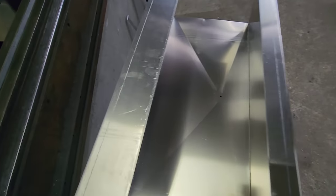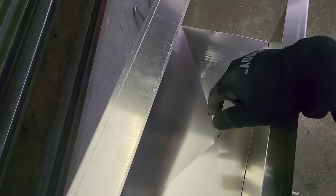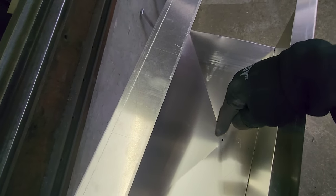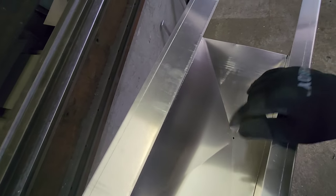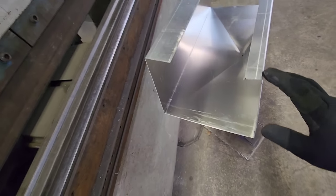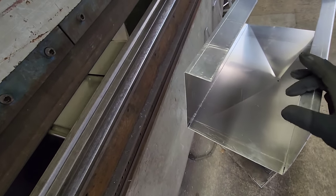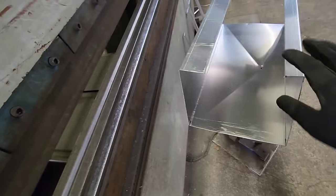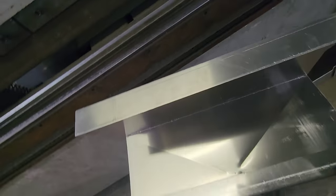All right, so there it is. You see how those bends look now, the little cross panels. In the center, I got a dimple die where I can punch a hole in the center and then recess it, just like the sink drain in your house. We got a fitting that's gonna go in there, make this thing look nice and cool. And then on these sides, I'm gonna bend these as one piece up and come over an inch and a half here. Then we'll weld this thing solid, check it for leaks, put this thing in the boat. Let's get back to work.